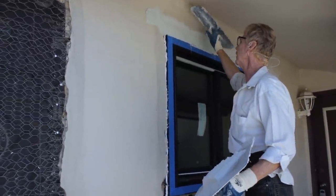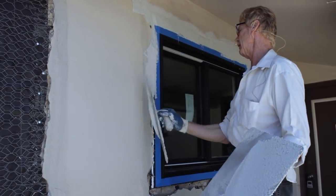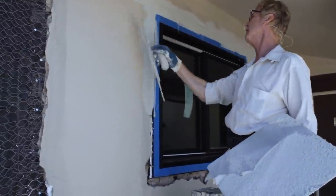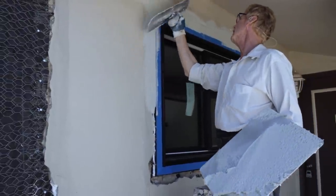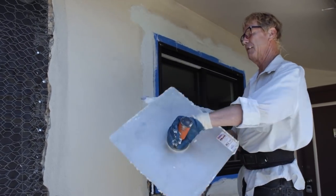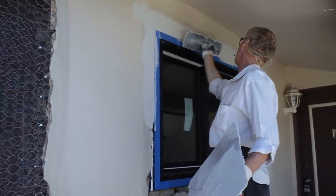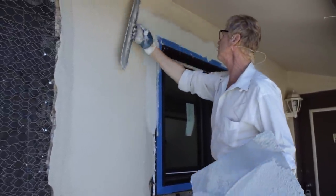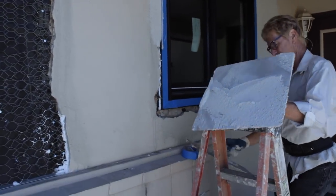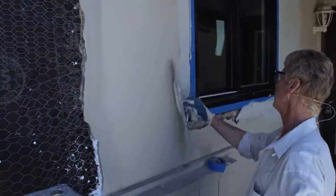It hangs very well on walls too. As a rule, when you're doing tops like this, fill it up like so and then try not to hit the frame with your trowel — just shave it. Now that's ready to be floated. This last piece here, because I got the blue tape on it, I can just finish up doing it cleanly.